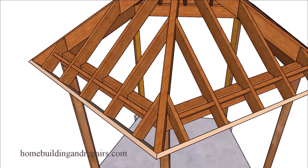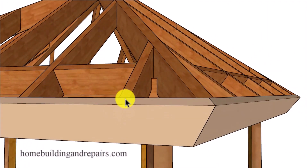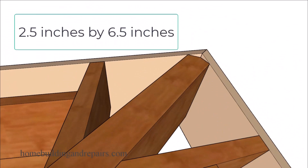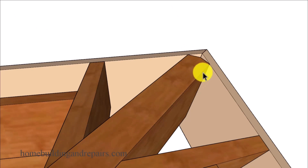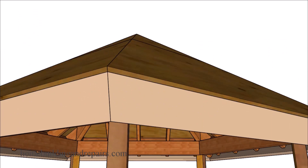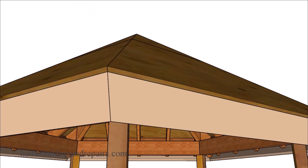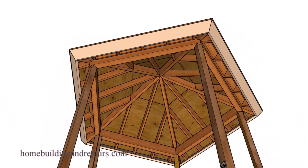Next up let's go ahead and install our fascia board. The square cut I was referring to is right here to position the fascia board, and the jack rafters will line up with this edge. I'm using 2x6 in my model for the rafters and a 3x8 for the hip that was actually shaped - I think I shaved an inch off of the width to make it look a little better from the bottom. The corners or edges of the hip will line up with the fascia board. Once we put the plywood on there will be a void or area that won't provide a solid surface for the sheathing, but you shouldn't have a problem with that - and if you're worried about it, shape the top of the hips.